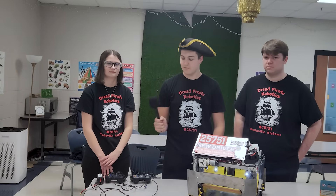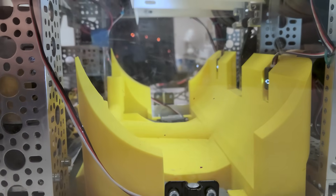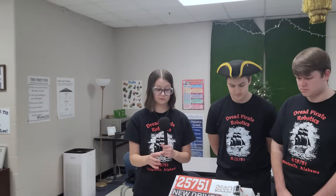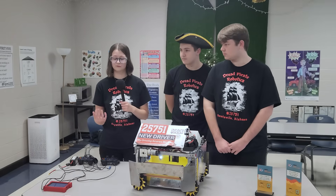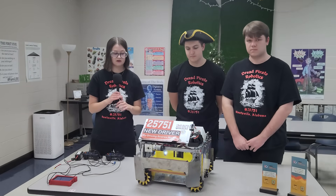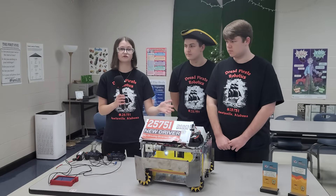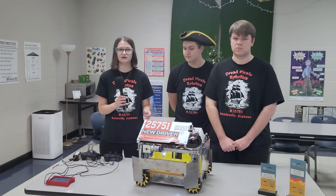Moving on, Caroline, can you talk about your gravity feeder? When it intakes, the artifact goes up a little ramp and inside it's completely gravity-sorted. The tray is designed in CAD and 3D printed. First we made it out of Legos to see how balls moved through it. After finding dead spots at the first qualifier, we used modeling clay to shape different areas. It has a ramp in the middle that splits artifacts left or right, holds three, and when one moves the third falls back into place.